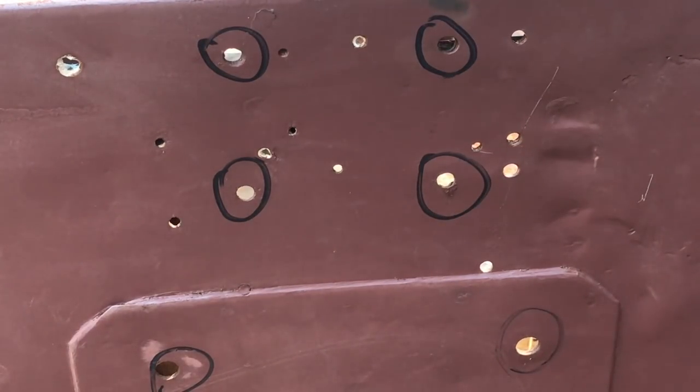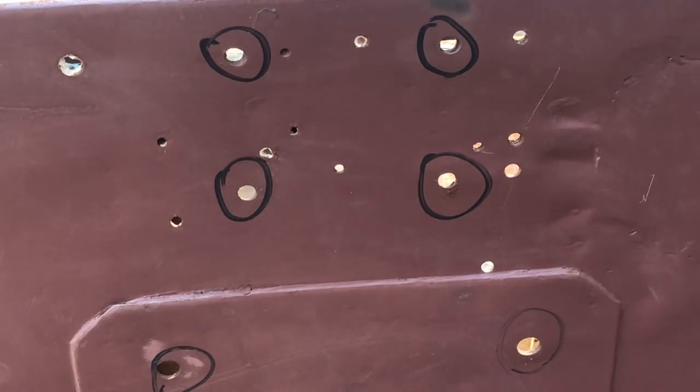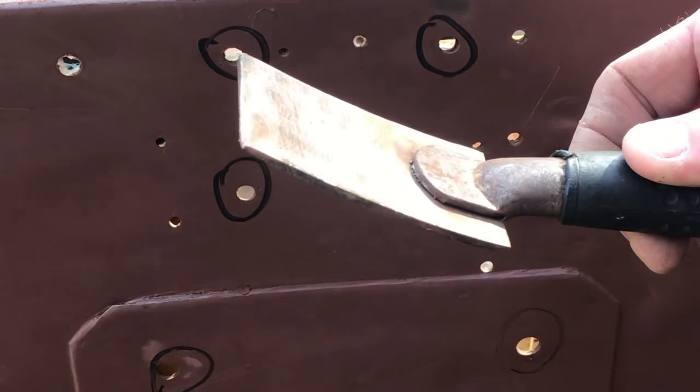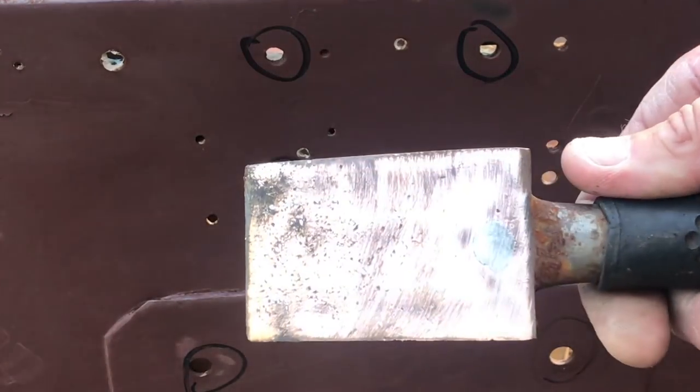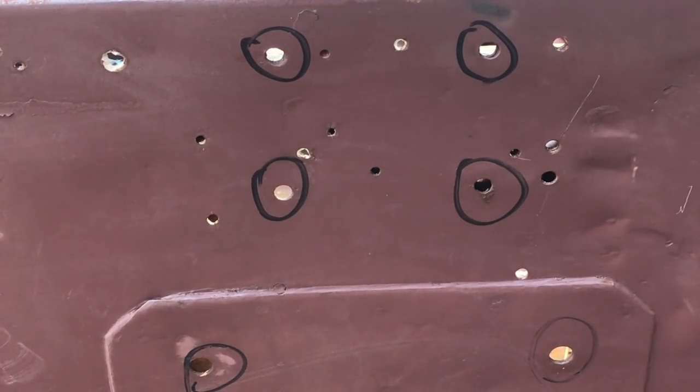Another thing you can use is an actual piece of 3/4-inch plumbing copper tubing. You can get into the radii and round areas with that where you couldn't with the flat stock. And this is kind of the store-bought tool — this is just a welding spoon, it's got a curve to it, and I've used that quite a bit. Get it cleaned up so you can see it is copper.